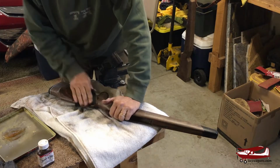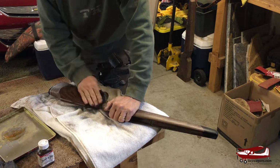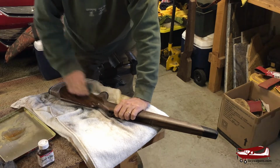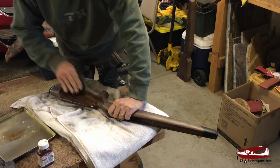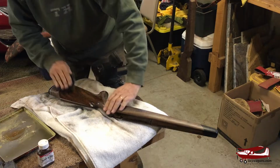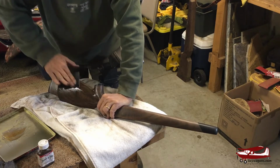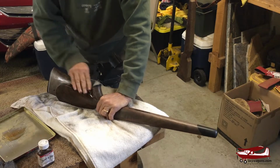And then as you're rubbing it, the superfine sandpaper is making superfine sawdust. That grain appearing. And it's jamming it in all the holes again. So like I was saying before, the sandpaper flattens. The steel wool polishes. So if there's a bump, the steel wool will make it a smooth bump. But the sandpaper will remove the bump. So this is sanding off the high points and making that dust go into the low points.